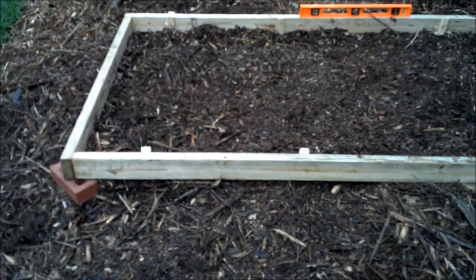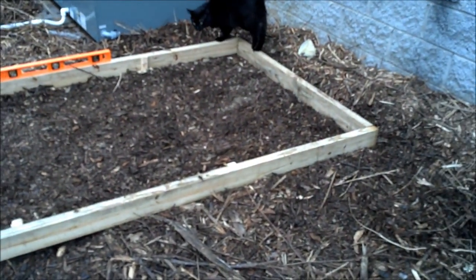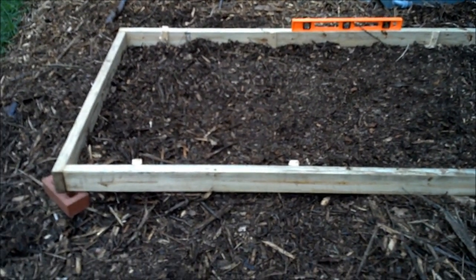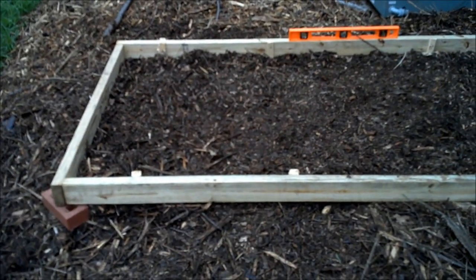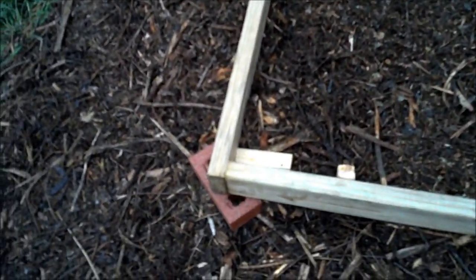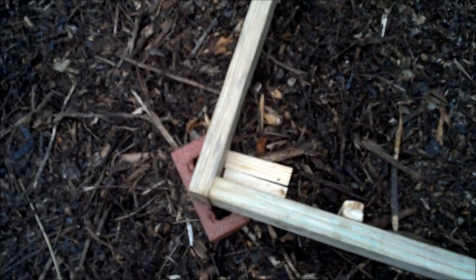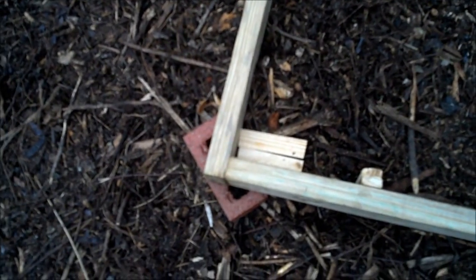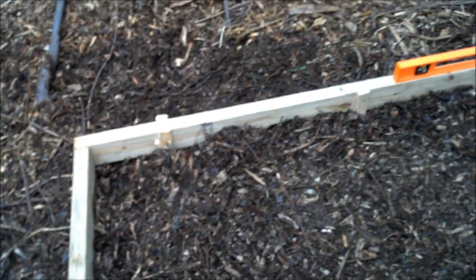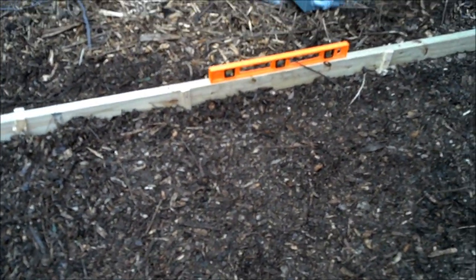This is a pretty simple setup. You've got a four-foot piece on each end — four foot right there, four foot right there — and two eight-foot pieces going the length. Level out the boards, screw together. For extra support and to make the interior square footage slightly smaller, I've got it kind of toenailed there and then an opposite toenail there, and it just follows that pattern all the way around so no one piece is kind of screwed together in the same way.